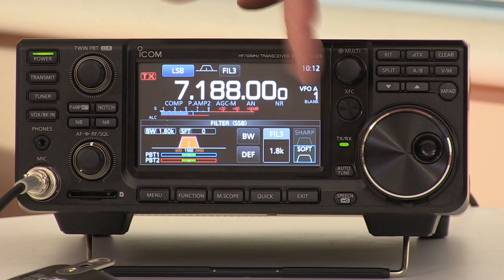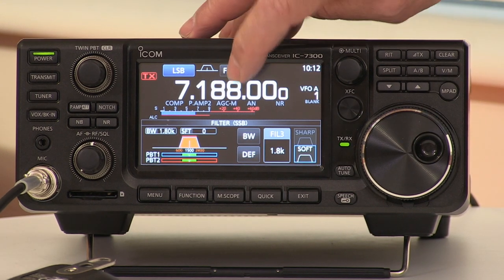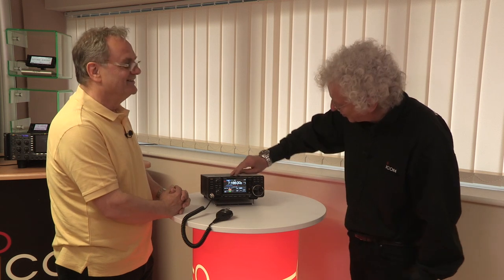The bandwidth can be as wide as 2.9 kHz or as narrow as 50 Hz, and that setting stores for that filter position. You've got three positions but you can customize them to suit your own requirements — so there's enormous flexibility depending on what mode you're using. When you look at the bandwidth as a graphic, normally you'd talk about it having skirts, but this one wears trousers — they're sort of straight down, very sharp skirts. You can alter the filter shape, but the characteristics are very sharp, so if you've got an adjacent channel signal it will cut it off very sharply.